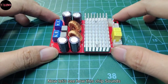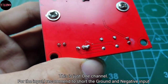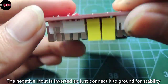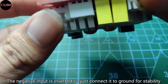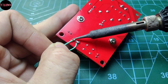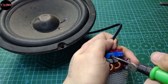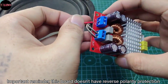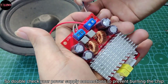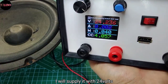Now let's see how this chip sounds. This is just one channel. For the input, I recommend shorting the ground and the negative input — the negative input is inverted, so just connect it to ground for stability. I will use this 8-inch woofer for the sound test. Important reminder: this board doesn't have reverse polarity protection, so double-check your power supply connections to prevent burning the chip.